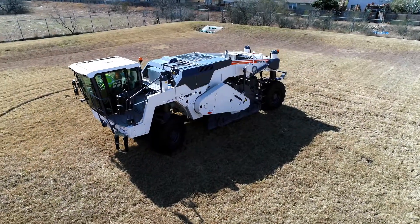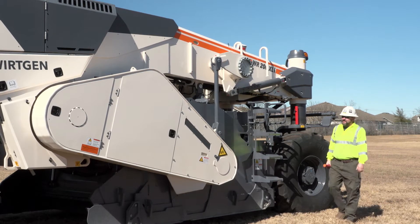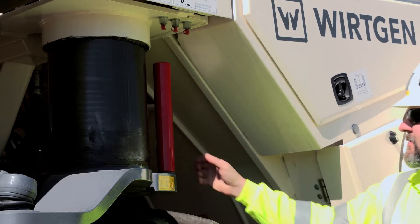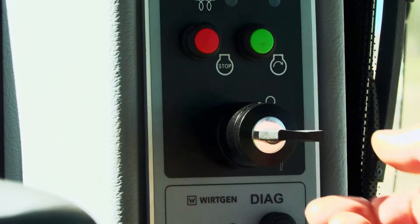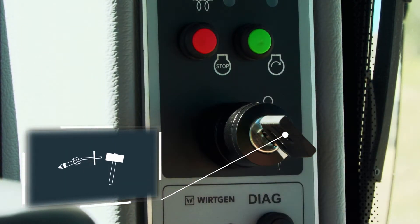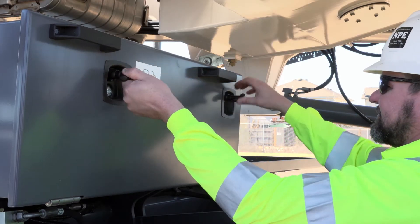For daily service and maintenance, to perform maintenance work under the machine, the red safety supports must be mounted at the points provided for each lifting column. The machine is then lowered onto these supports. In addition, the key switch must be set to the tool replacement position. If the key is then removed, operation of the machine by third parties is no longer possible.